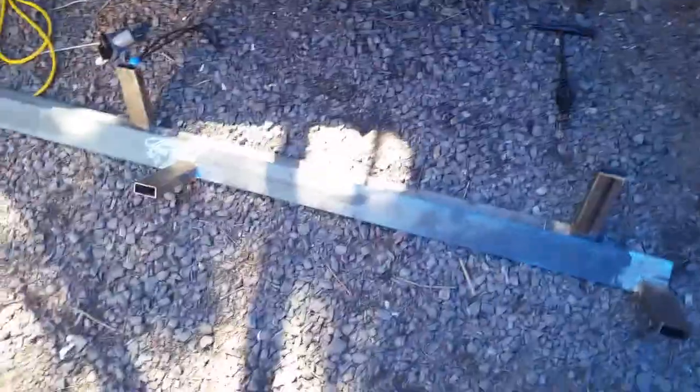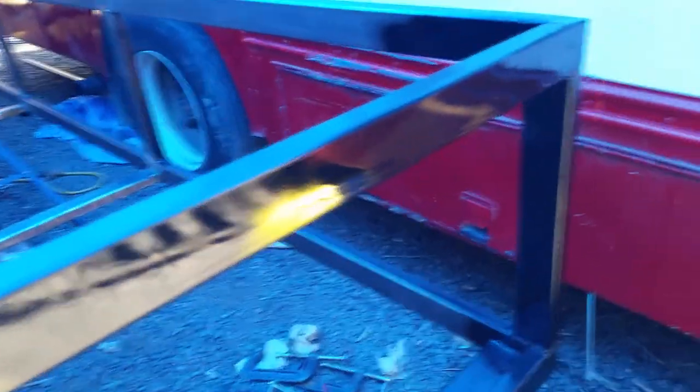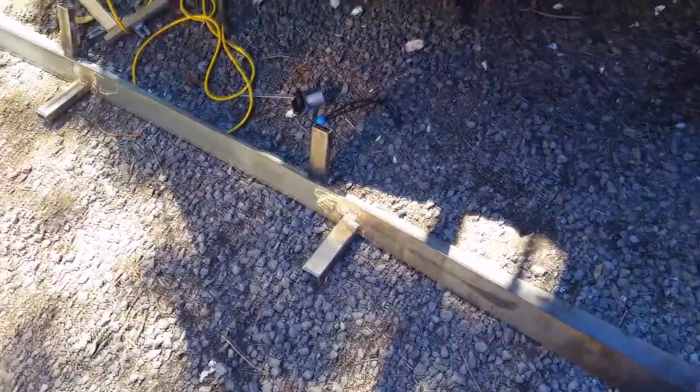Here's how the legs turned out. I used the welding magnet to hold them in place and weld them up separately. Now I'm going to flip this over and weld them upside down to make it a little easier. In the meantime I started painting this — paint is important. Not only does it look nicer, it keeps it from rusting. This stuff will rust up pretty quickly. If these are not all lined up correctly, or if I got the angle or the length wrong, I'm going to be hating life. But I think they're right, and we'll deal with it if it happens.